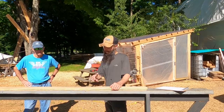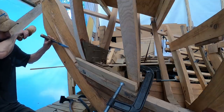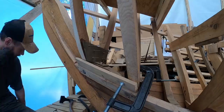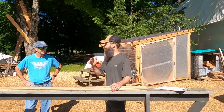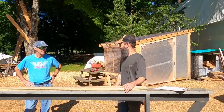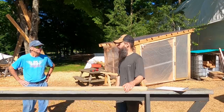And while you guys are working on this, I'm gonna jump in the boat and go work on the stem and the stern and fairing in those sawn frames and working on chopping the rabbet. And that's gonna take me a couple days to do both stem and stern on starboard and port. So I think by the time you guys get the patterns made, get the cedar picked, get the cedar cut, the cedar scarf has a little time to glue, that should give me enough time to get that done. And then when you guys are wrapped up with that cedar and it's about ready to be hung, I should be done with the rabbet and the frames and we can start putting them on.